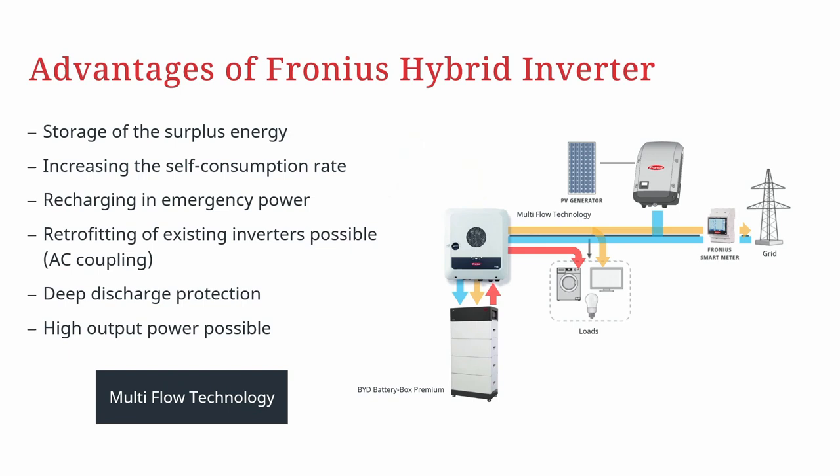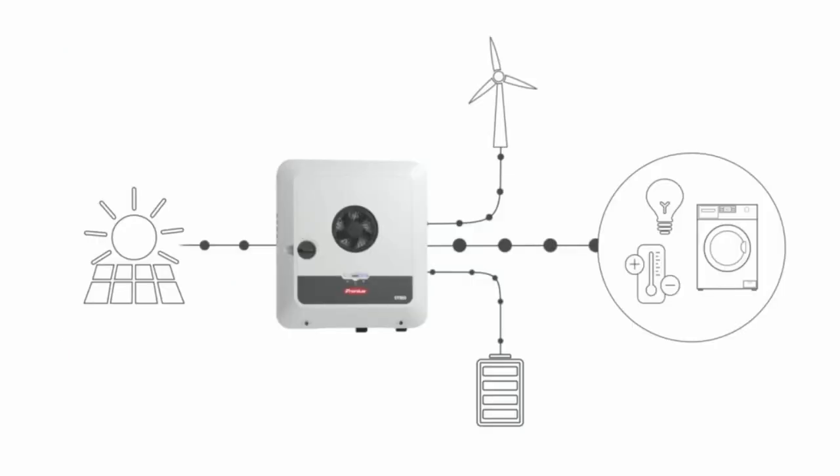There is one key fact about AC coupling: whenever your Gen24 Plus device is powered by a battery system, a PV generator, and an external AC power source, please note that when the public grid fails and you go into full backup mode, the external AC power source will go offline. This is because the Gen24 Plus produces a new grid at 53 Hz of alternating frequency, causing all other external producers to go offline. The Gen24 Plus is, so to say, the boss in the system — it controls the energy flows and ensures there is no overload.